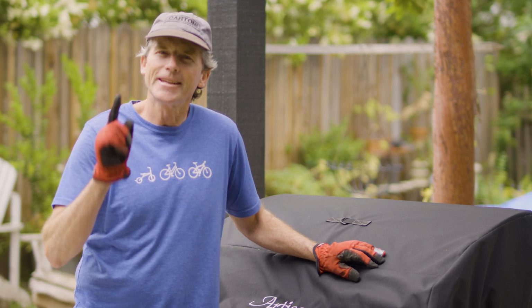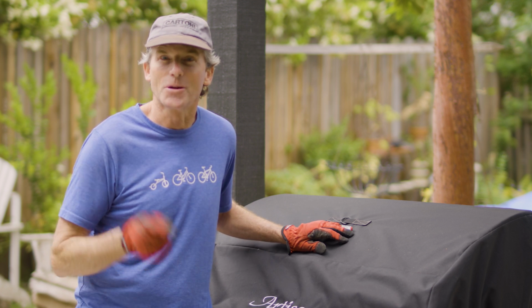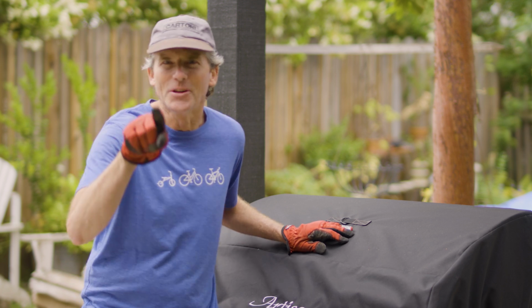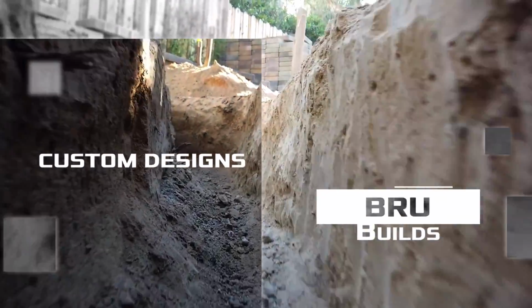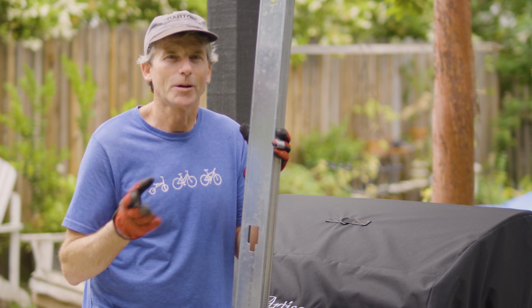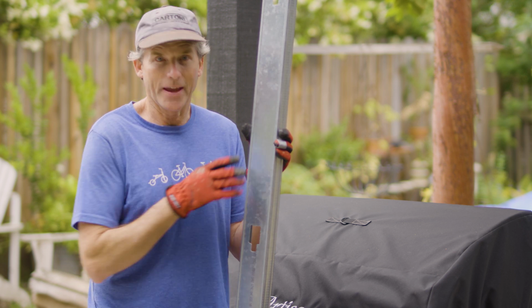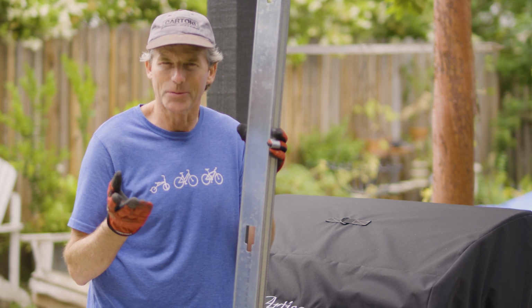I'm Paul. Today, I'll start building the structure for the fireplace and this barbecue in our backyard. You ready? Let's build this. I'm using metal studs to build a fireplace and barbecue structure. The advantage of using this over wood is metal can't rot and it is fireproof.